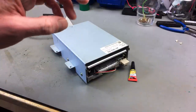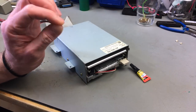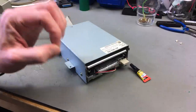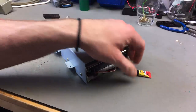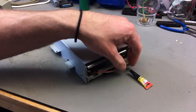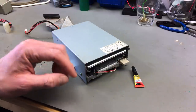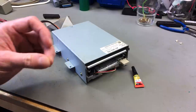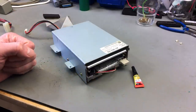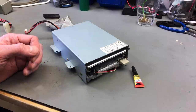And there also is a so-called activator, which makes this set a lot quicker, so you can work a lot more precisely. And it's also going to make a much sturdier connection if you use the better cyanoacrylate glue and the filler, which I believe is an even finer powder than baking soda. So if you want to do something serious, use that stuff if you have the opportunity to get it. Just wanted to point that out, because it got pointed out to me after I tweeted about this. Thanks again for pointing it out, unnamed person who pointed it out to me.